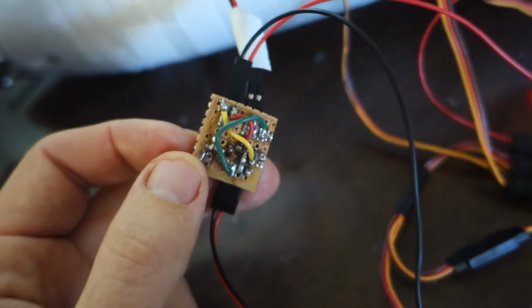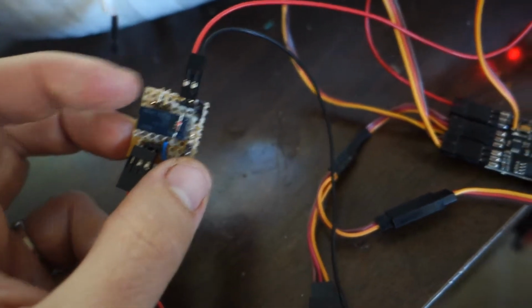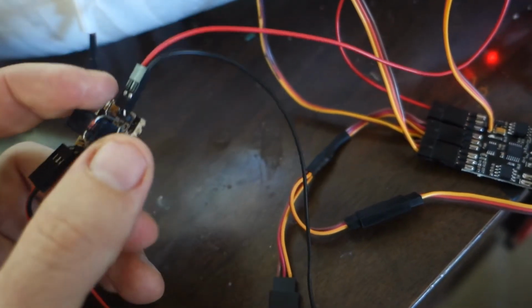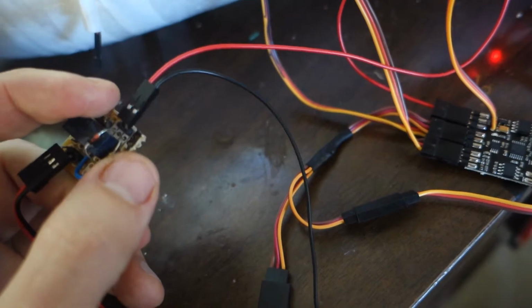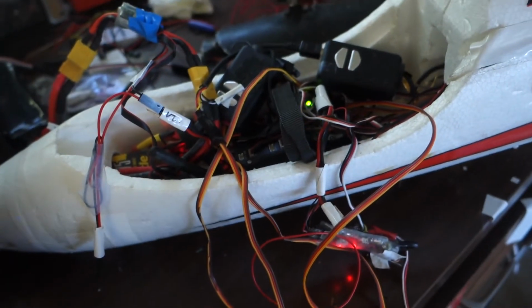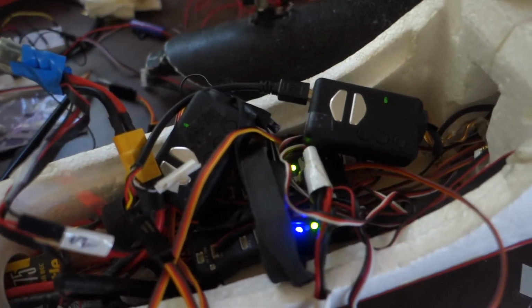That's the back. I mean, nothing too major. And the way the relays are connected are that when the relay flips, it also de-energizes that resistor, so it's not being powered all the time and wasting power. I'll flip it on one more time. Engines armed. So you can see both cameras coming on and powering on.